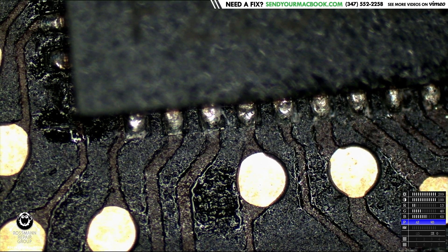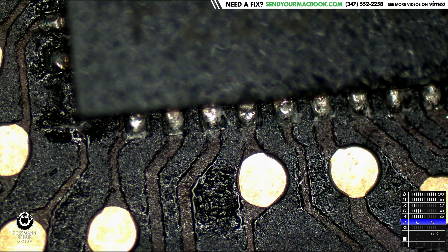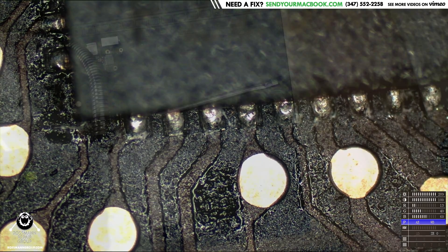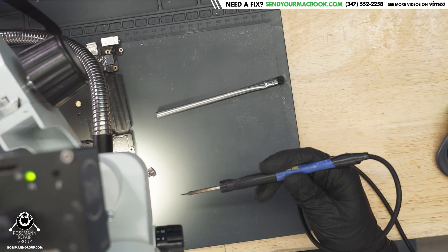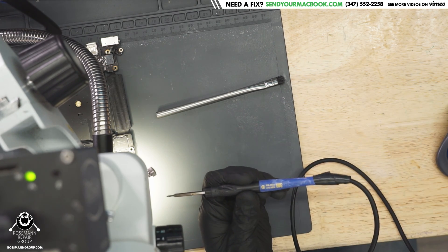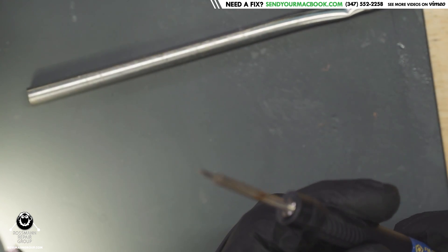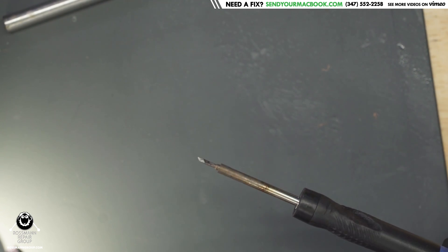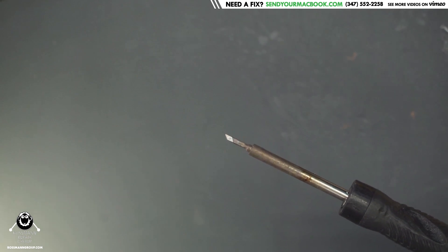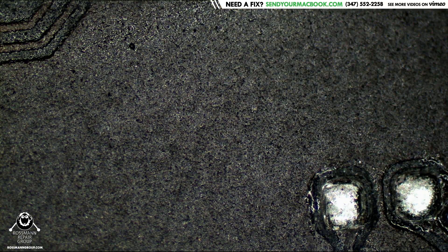So what are we going to do? We're going to turn on my fume extractor and turn on my soldering iron. I like to use a T30-KN tip with a Hakko FM-2032 — you can see that I keep mine in immaculate condition, tape everywhere. There should be a link in the description below. The T30-KN tip is shaped like a chisel or a knife at the end — I like that shape because it makes it easier to do QFN retouching.